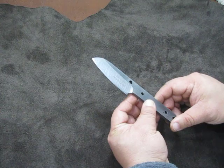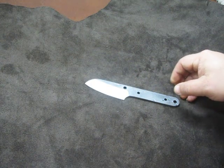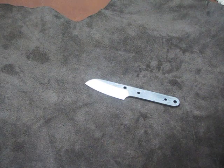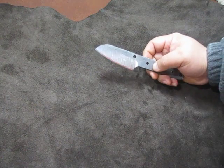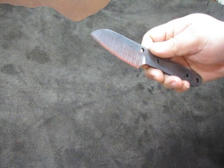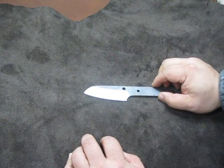It is a very, very wear-resistant steel. Farad says it's got 36–38% carbide volume and 10% tungsten, according to the data sheet — or certificate of authenticity — he sent me. Carbon is at 3.4%, chromium at 4%, vanadium at 9.5%, tungsten at 10%, cobalt at 9%, and molybdenum at 5%. It is very hard to work with. Farad says he buys 200 ceramic belts at a time and he's gone through more than one batch of those just trying to grind these knives.